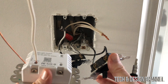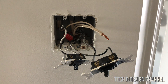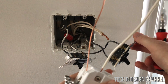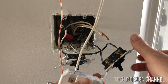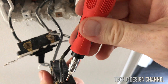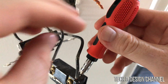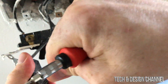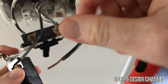At this point we just copy what's happening with the existing connection — this one connects to this one, and so on. We're doing it one by one to avoid mistakes, and of course you took that picture of the whole connection before starting. To take the wires out, a small flat-head screwdriver usually works well — press it in, then pull the cable up and it should pop out. Sometimes it's hard, sometimes it's easy.